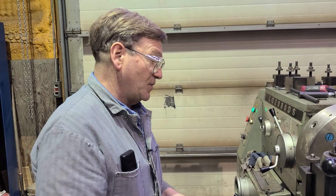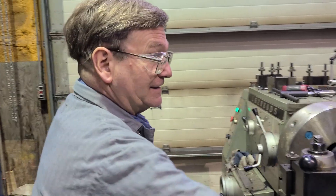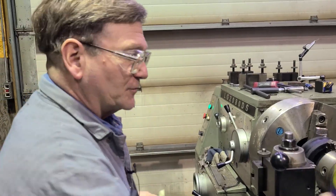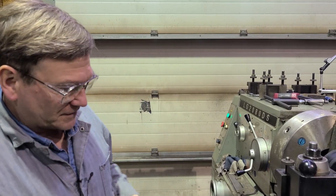Something that really helps when you're slicing rubber like that is a little bit of light lubricant. Old machinery manuals generally say kerosene, which is just a light lubricant — though it does tend to catch fire. Number one diesel might be a little better, but WD-40 is handy because it's already pre-pressurized and comes right out. There are several other options too.